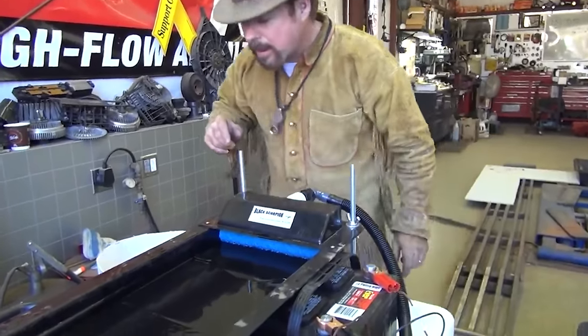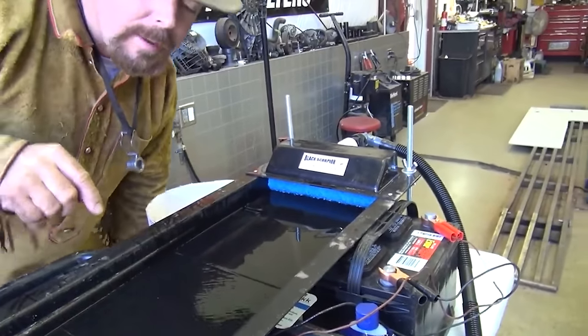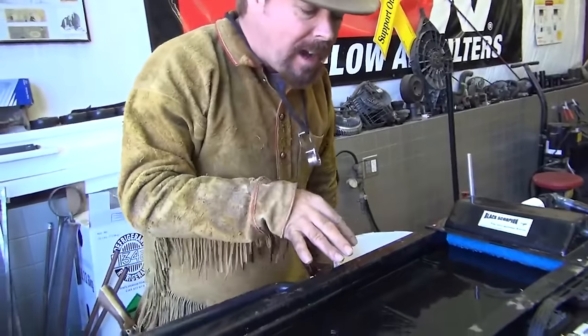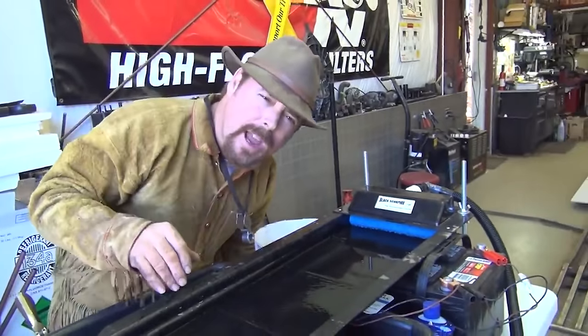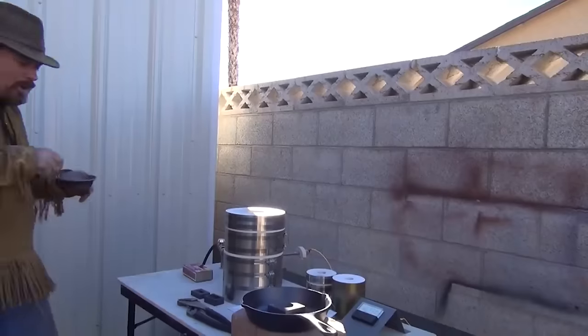That's really important. If y'all were working with gold, of course I'd probably increase the water flow because gold's a lot heavier. But in this case, I'm working with sulfides, and sulfides are not that heavy. So I gotta be real careful when you're running it. I highly recommend you put some Jet Dry in your water just to break the surface tension. That way, super, super fine gold will drop out and it'll stay there. It won't try to float along the top, because I've seen some super fine gold floating on the top before. And yeah, gold does float.